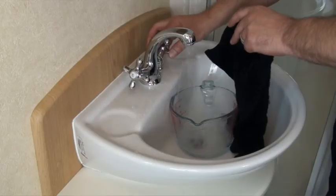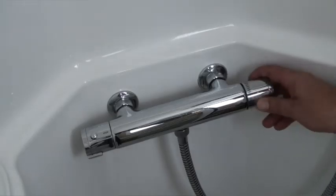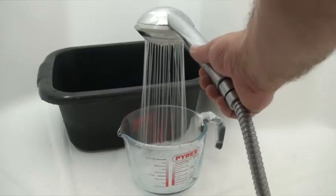Now that you've carried out the drain down, it's important to carry out a little checklist to make sure that you've drained everything. Make sure that you've drained all the hot and cold taps in the kitchen, bathroom and en suites. And don't forget, if you have any other outside taps or faucets, you'll need to drain these also, just using the same process. Also, remember to make sure that you've drained the shower by turning the temperature lever all the way to cold and then all the way to hot. Don't try to drain both at the same time by leaving the mixer in the middle, as it's just not as effective.